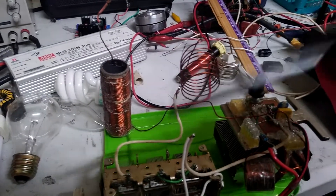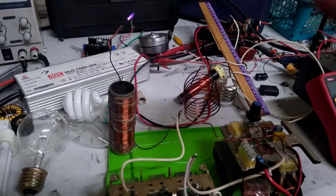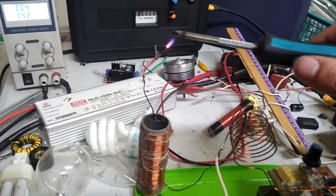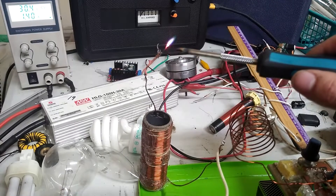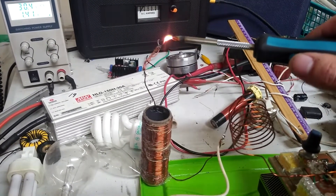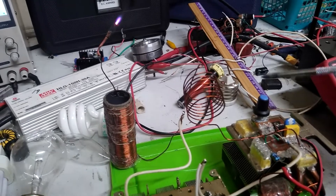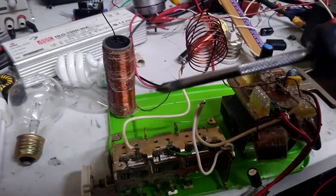It seems like you've got to get so intimate with all the variables and how you're setting them — to more or less memorize what you need to do to get this thing at its maximum breakout depending on the voltage you're feeding it. There's going to be an upper limit of where I can crank this gate resistor to push power in, but at the same time depending on where that's at, I need to have this cap just right.